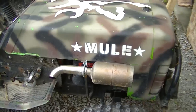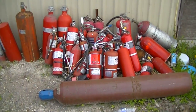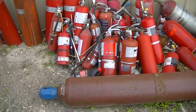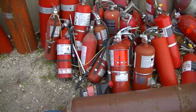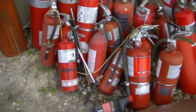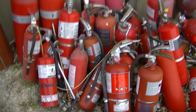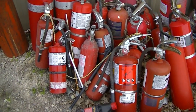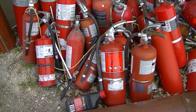So I decided I was basically going to follow the same theme this time. Instead of using the disposable propane cylinders like I did last time, I decided this time I was going to use a fire extinguisher. Now, if you're going to build something out of a fire extinguisher, it's worth noting that some of them are steel and some of them are aluminum. And if you're going to weld to it and you're not equipped to weld aluminum, you're going to want to choose a steel version.